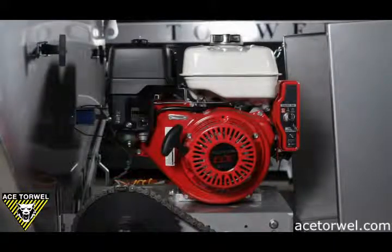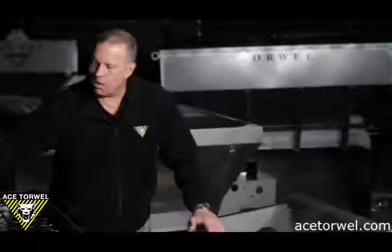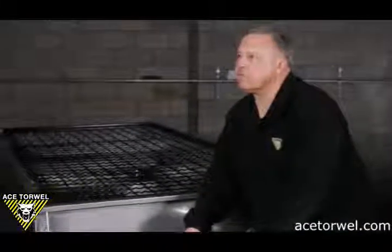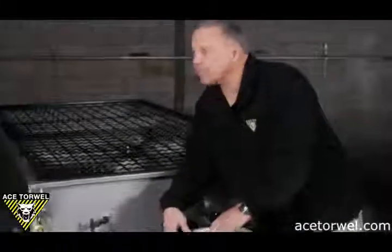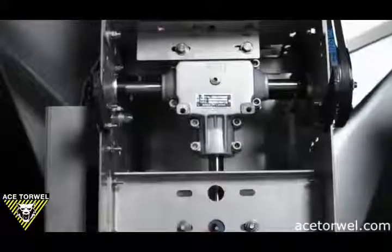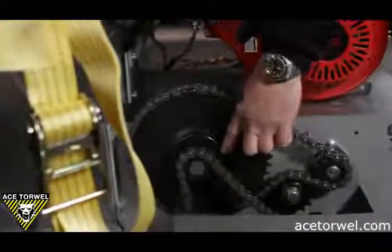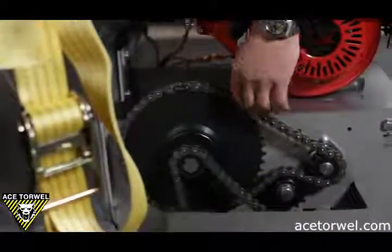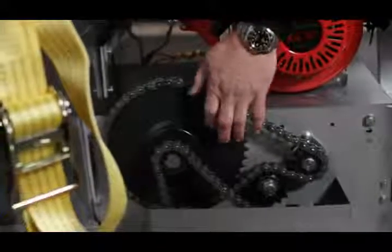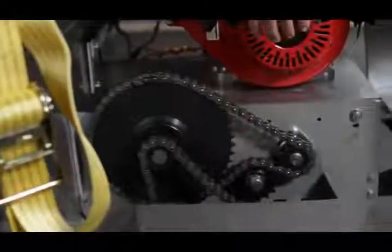We have a 12 volt electric clutch, which gives us the on/off capability within the cab to turn the conveyor and the spinner system on and off. The main transmission drive of the economizer mechanical unit is a one-to-one gearbox used on all of our mechanical drive assemblies. An additional feature is a shear sprocket assembly — if the load were to become frozen or stuck, the shear pin would break, resulting in the stopping of the conveyor chain and no damage to the unit.